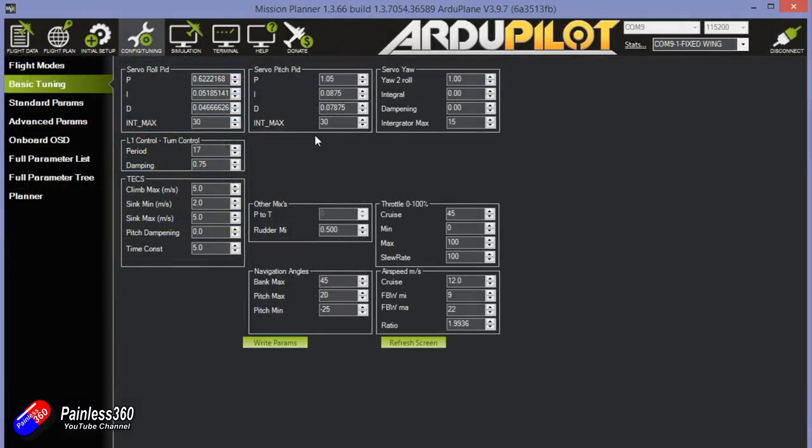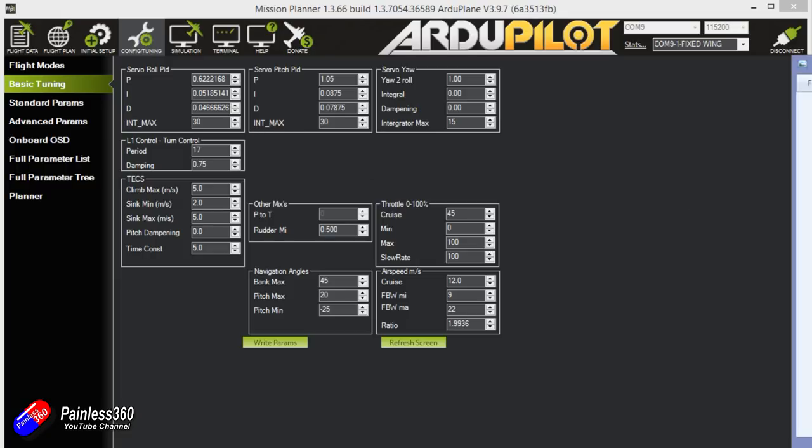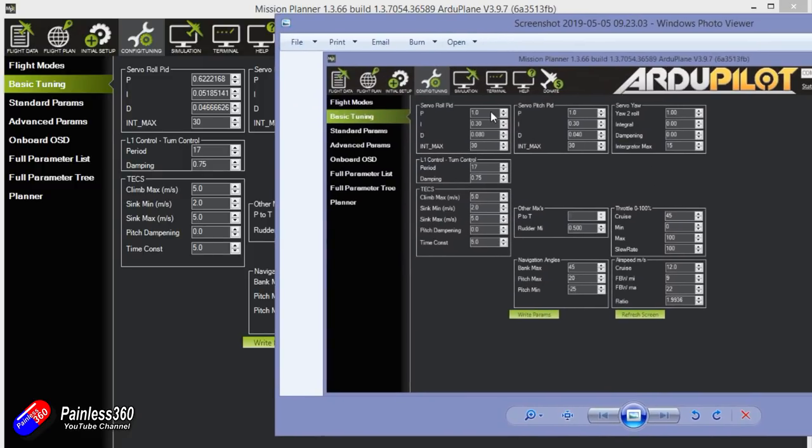Here are the new PIDs following that flight. Comparing them to the original PIDs, you can see they have been reduced dramatically. Hopefully these new PIDs will be the ones I'll use now. I'll probably repurpose that switch and flight mode position from auto-tune for something like auto, set up auto-launch, which I'll probably do in the next video.